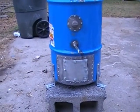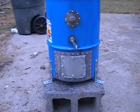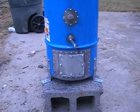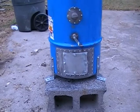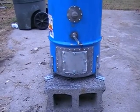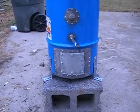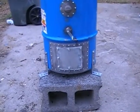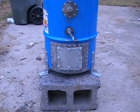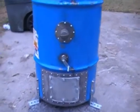On the bottom of the unit there's two steel plates. You have a larger one, then you have a smaller one in the center. This is where you remove the biochar or the ashes after you've been running the unit. It almost looks like an old boiler that you would see on a train with rivets all the way around it. The largest plate was to give it more tensile strength and also to make the door smaller so it would be easier to seal the unit. I had to have a larger hole on the barrel so I could get inside and put all the parts in. I used that outer piece of steel to shrink the hole, with the smaller center piece being the ash removal plate.